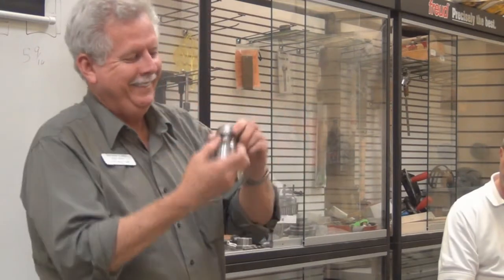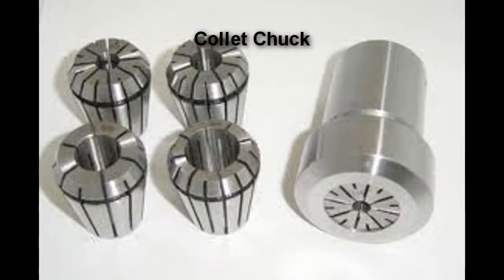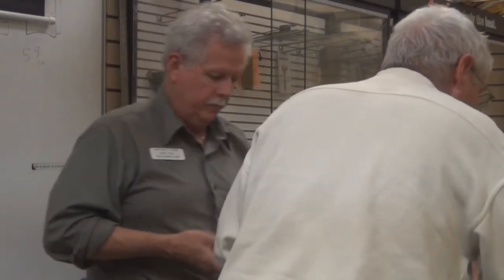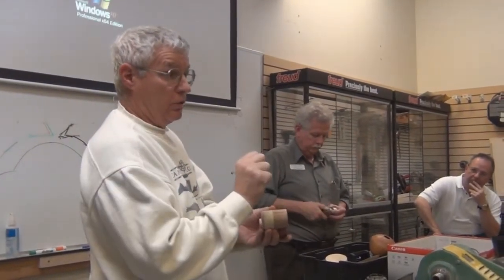You don't have to do that. What you can do is spend a whole lot more money and buy a set of collet chucks. Chuck, you have some collet chucks in yours, only they're homemade, right? I have. These are collet chucks that I've made - I just drill out to what I want to hold, put it through the bandsaw, put it in the long jaws. The long jaws just crush that and do a wonderful job of holding it. That's inch and a quarter for the inch and a quarter aluminum that I was using to make handles.